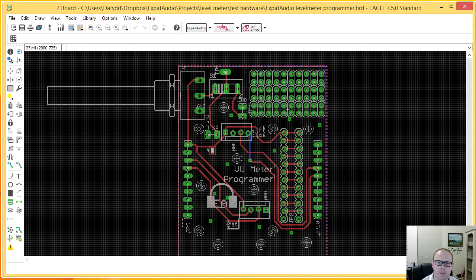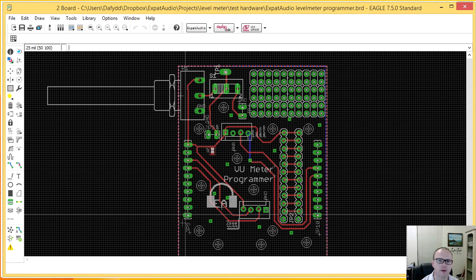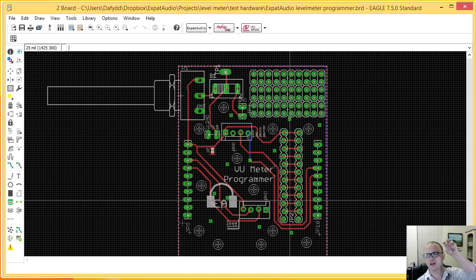This board pairs on top of that MSP430 launchpad that we had. These two long headers down the side here are actually mirrored or paired to what's on that launchpad. Essentially I have an array here of the footprint, the screw holes and so on, and the pins. For instance, these are your dedicated programmer pins. This is your analog input pin, and here we have the serial port connection and so on. What we do is tie all this together and then plug this board on top. This board truly is designed to just mate on top of the launchpad, and off we go from there.